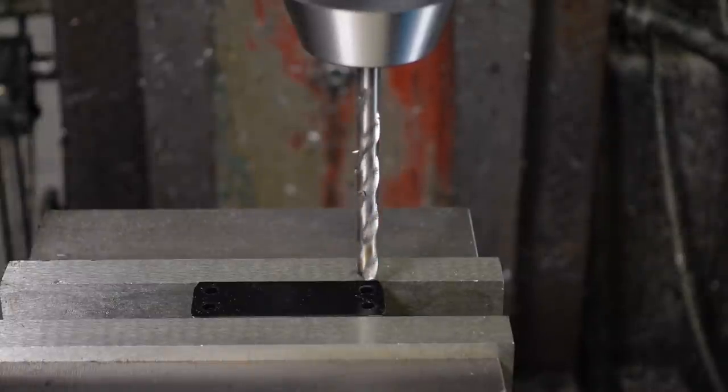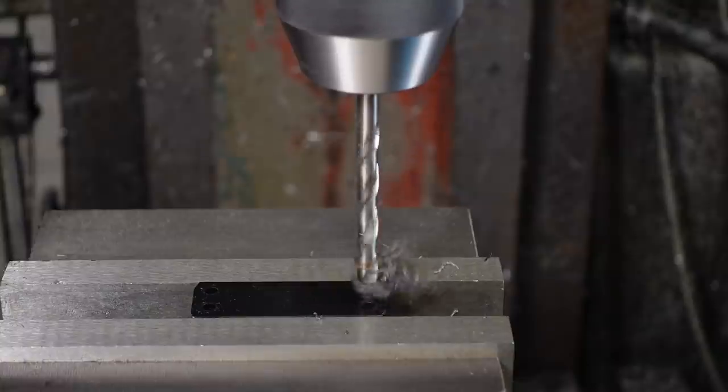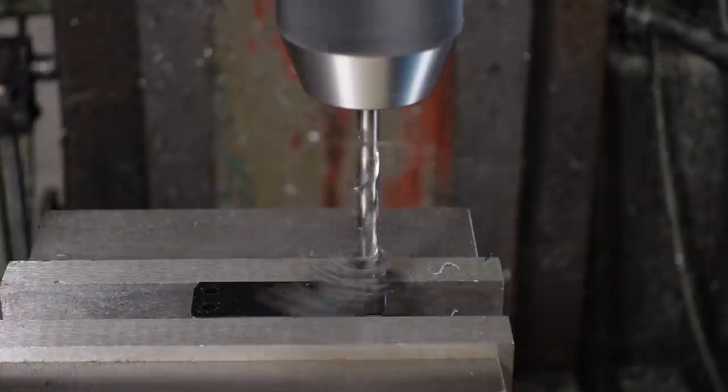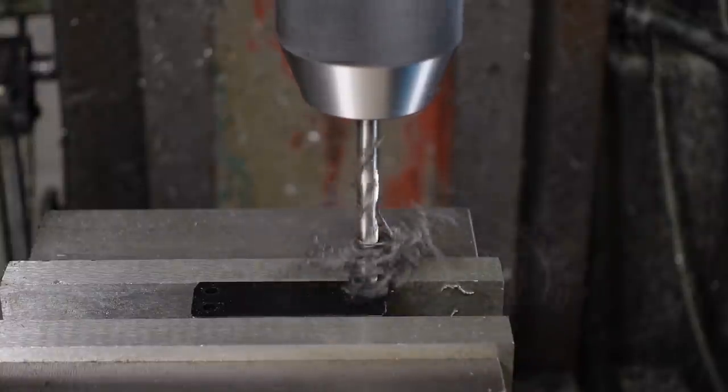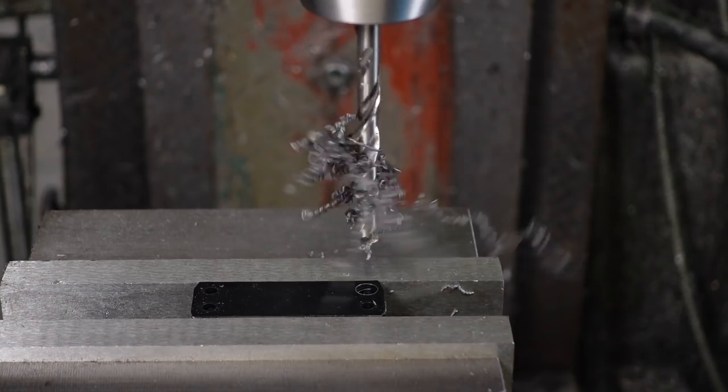The counterbores are 7mm, a little undersized for the pressed in threaded inserts and collars. I made sure the drill stopped at the right depth by using the mill depth stop. Nominative determinism in action, perhaps. It's a good name. Describes what it does.